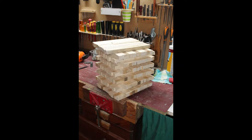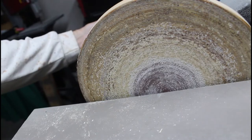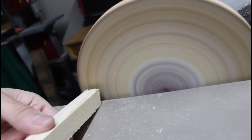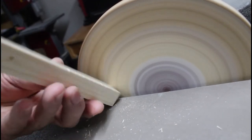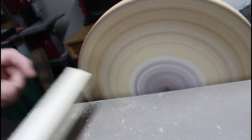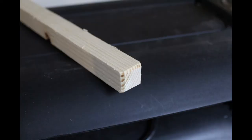At the end of this process you should have all your rough sawn uprights and bottle supports. Now you will need to hand or machine sand all your uprights and bottle supports so as to get a nice smooth finish. These will have a few rough edges and ends coming straight off the table saw. Please do not skip this step, as the difference between doing this and avoiding it will be very evident in the finished product. And anyway, who wants to be getting splinters every time they reach for a bottle? In particular, take time on the exposed ends of the bottle supports.